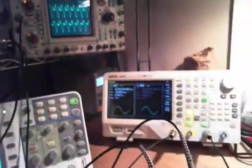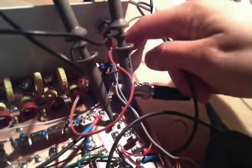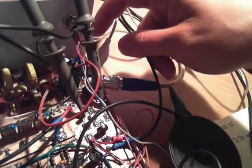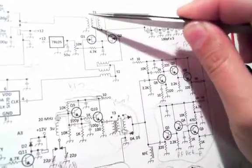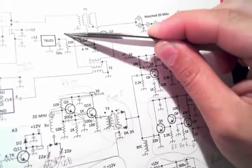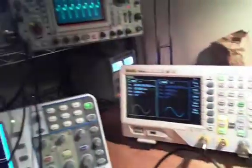What I'm going to show you now is the bias on the FETs on my voltmeter. This is the voltage coming out of the voltage divider, with the trimpot here to adjust it. I'm measuring before the resistance that goes there. On the schematic - those are the two FETs, one transformer, two transformer, and we have five volts up here. We're adjusting between zero and five volts to control the bias, and I'm measuring the voltage before that resistance. Right now we have five volts and I'm going to go all the way down to zero volts to show you what happens.